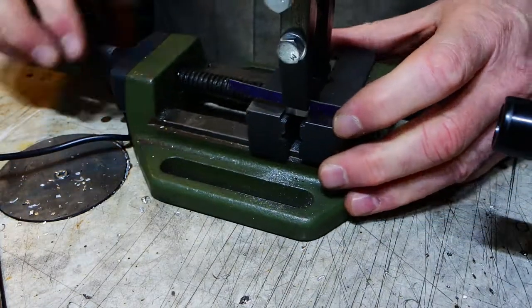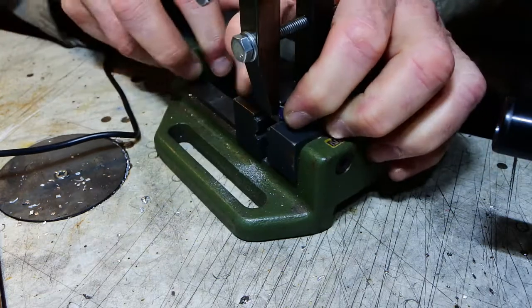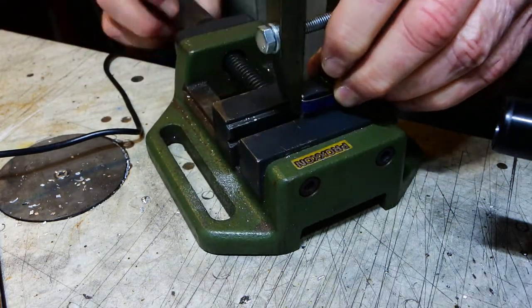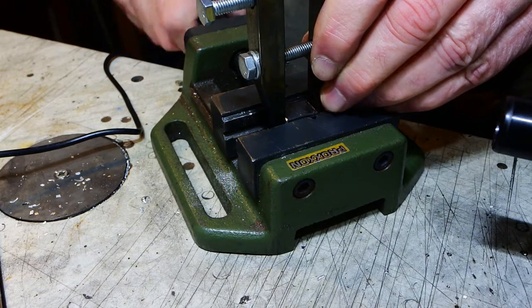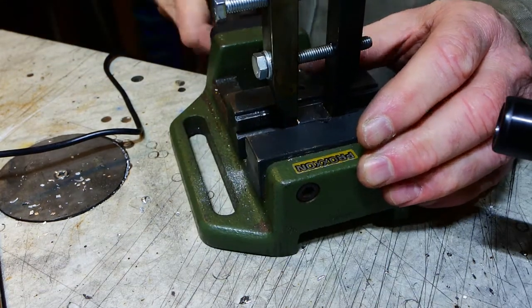I need to make sharp, accurate bends on this little strip. It's pretty tough to bend, so it's not going to make a sharp corner, and it's going to be difficult to get it accurate, so I'm forming it around a small 12mm block. Clamp it around on all three sides and you've got some chance that it will form itself to the correct shape and dimensions.